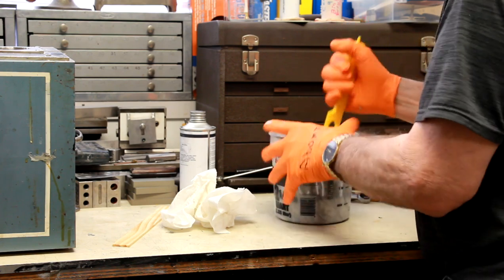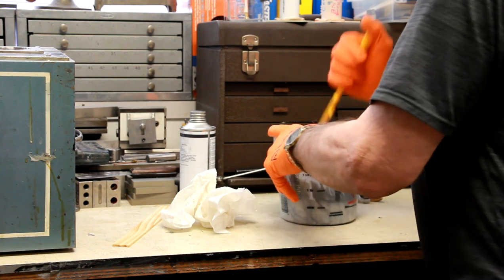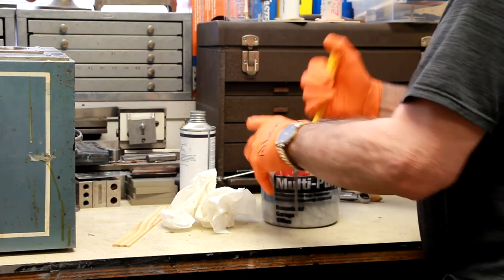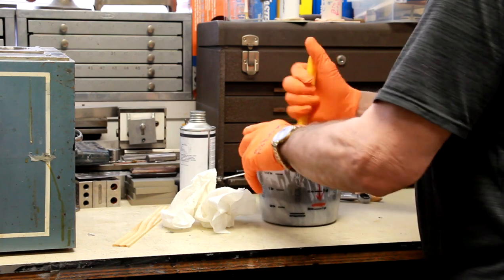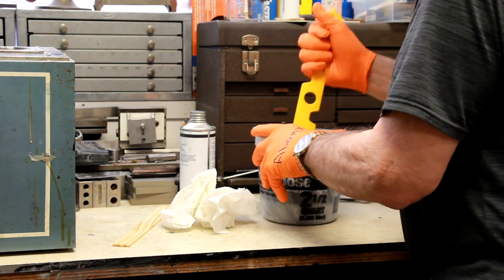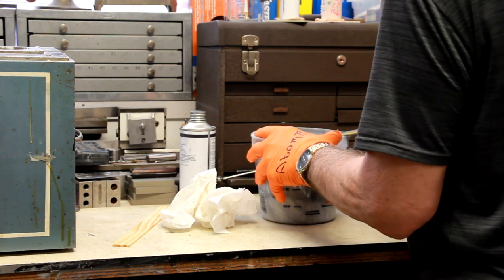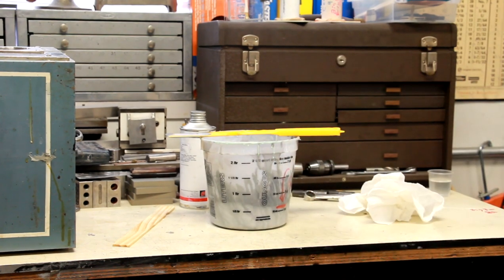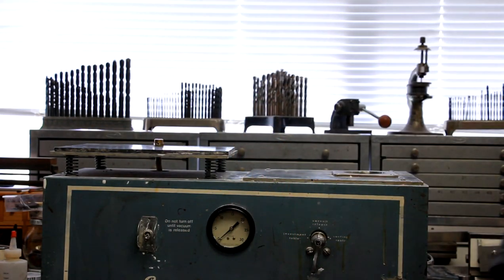This is not a very large batch by any means, but stirring this high viscosity RTV can give you some good cramps in your hand if you haven't done it in a while. Once it's thoroughly mixed, the next step is to place it under the vacuum chamber. This vacuum unit — you should be able to put a little cup of water under the bell jar and turn it on, and within less than a minute it should make that water boil violently. That's an indication of the strength of your vacuum unit.